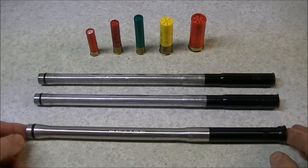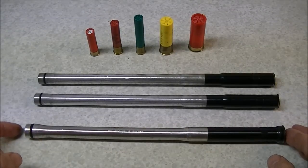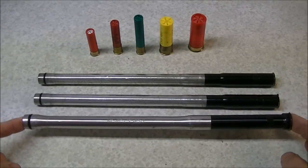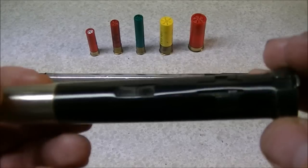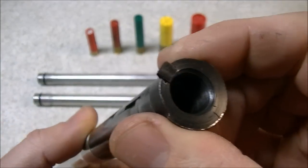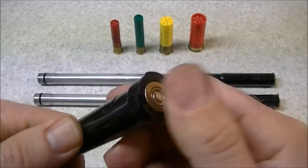There are a couple of different styles of these tubes around. This is the later style of tube with an aluminum barrel and a steel chamber end. The early ones were all steel and they were quite heavy. The later style with the aluminum barrel is preferable because they don't add quite so much weight to your gun. These are of two-piece construction — a blued steel chamber end with a built-in sliding extractor. You can see the chamber end of the unit there.